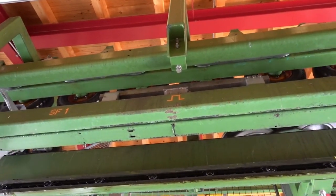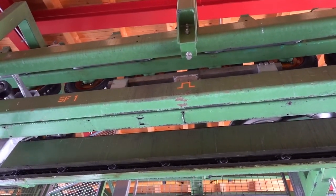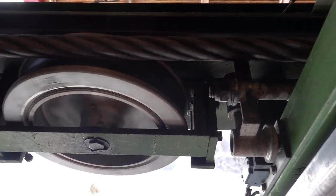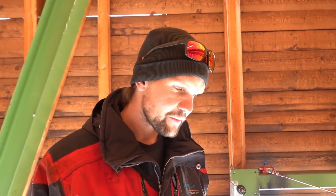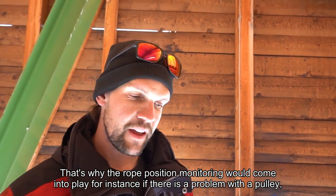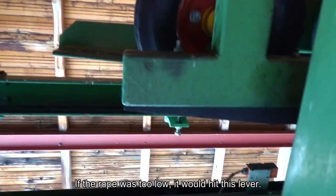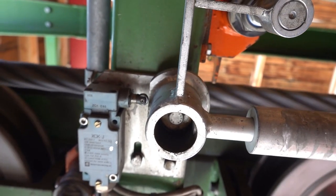What surprised me to find on this older lift is the clamp pressure sensor. In this lift it is separate from the coupling mechanism. It lifts the spring and if the required force does not match the specification, an error is issued and the ropeway is brought to a stop. This lift is also equipped with sensor blinds. The one shown in this picture gets triggered if the rope hangs too low. The exact positioning of the rope is crucial for the coupling to succeed.